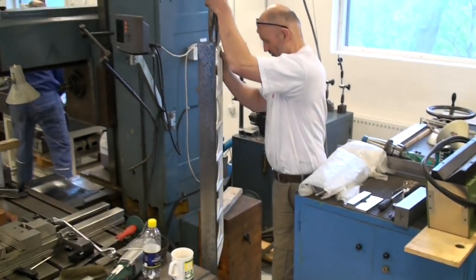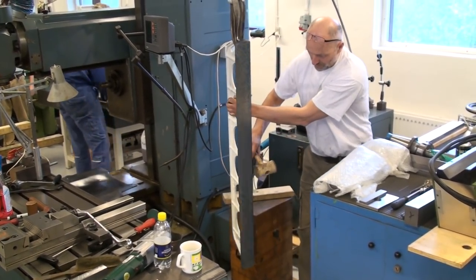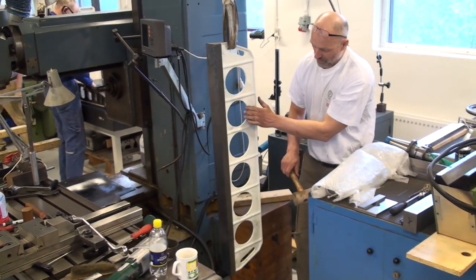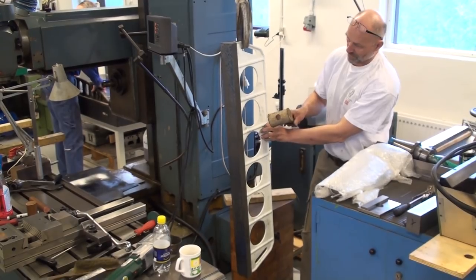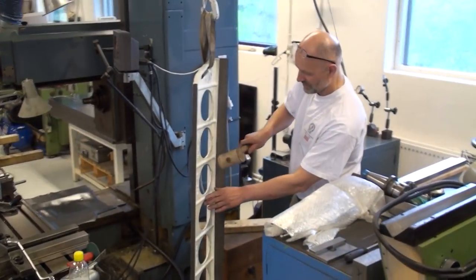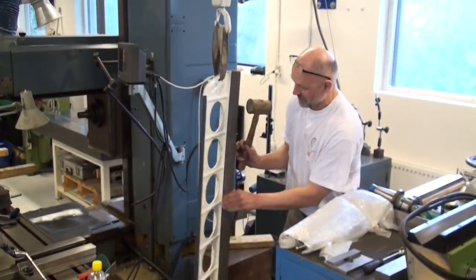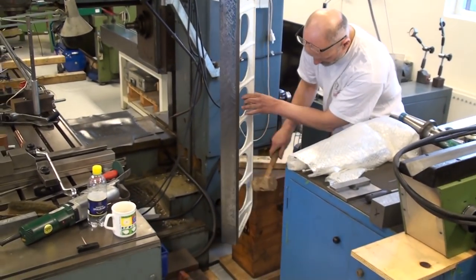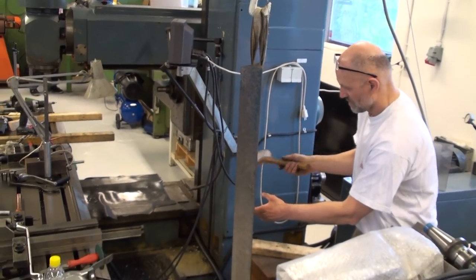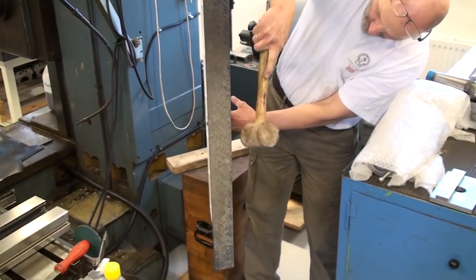Jan did some stress relieving on his 48-inch Kingway straight edge. For that purpose, he blued it up, he took a photo of the bluing, then he suspended it on a crane, and he hit it with a rawhide mallet a few times, quite heavy, and let it always ring out. This way you take out a certain amount of the stresses in the straight edge that could otherwise lead to deformation when you hit the straight edge slightly during use. So when you release the stresses when you're scraping, you're on the safe side later on.